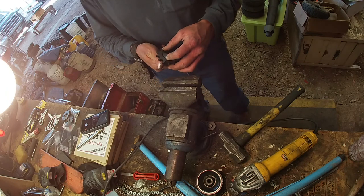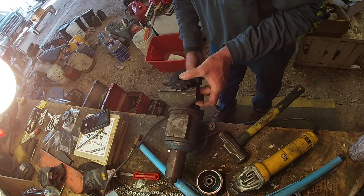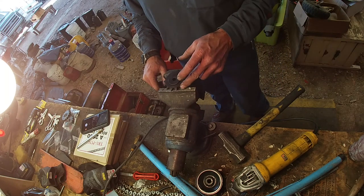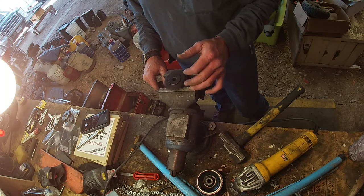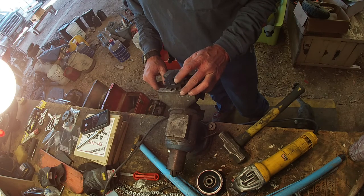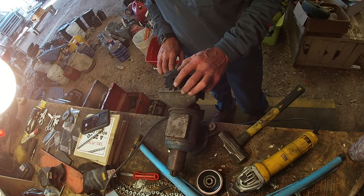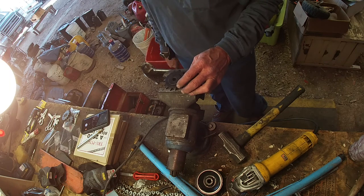weld this gear on here. For now, I'm just gonna tack it, see how everything works, because I may want a bigger pulley on here. I doubt it. The bigger sprocket I put on there, the faster the mill will run through the boards, but the harder it'll be to push it, crank it. This is about the smallest one I could get. I think there was a 13 tooth, but this is 14 tooth. So this will probably work, but let me get this tacked on here, and then we'll go down and put this together, and then we'll work on the idler pulleys.